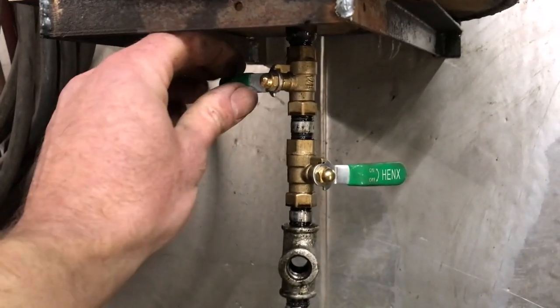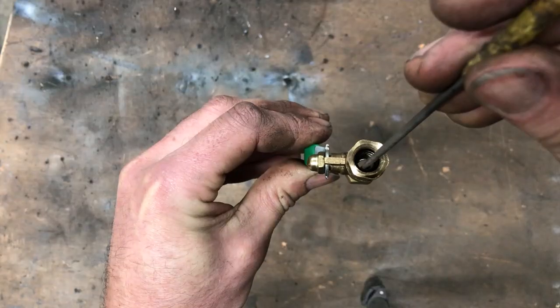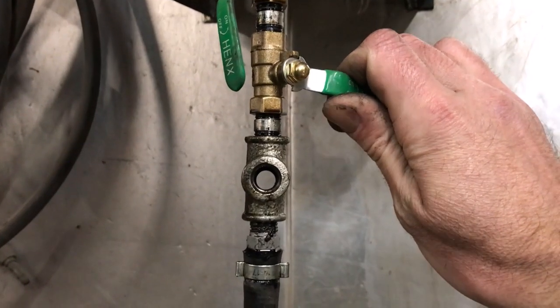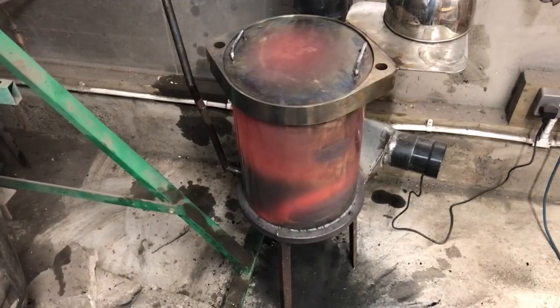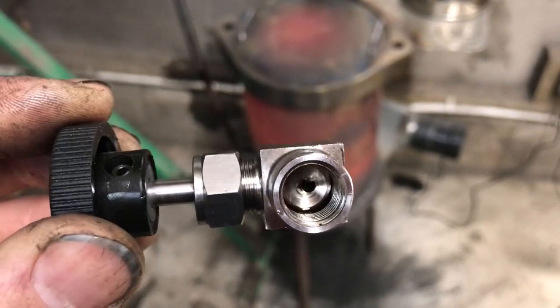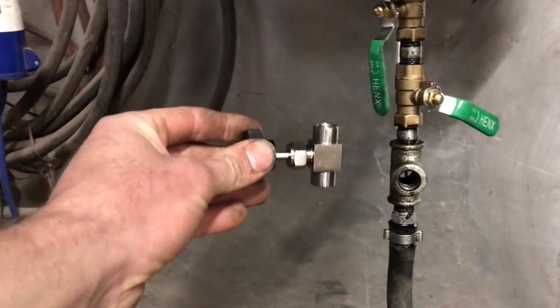I've got 2 ball valves from the gravity feed oil tank. The lower one I have modified to allow a finer adjustment of flow, and the upper one is just a shut-off. You can then just leave the lower one in its set position. I tried a needle valve, which was great for fine adjustment, but clogged up. With ball valves you can open them right up to clear any blockage, but only briefly of course.